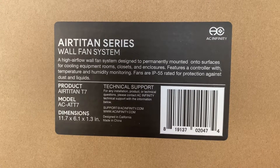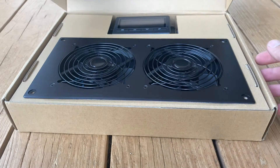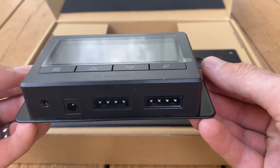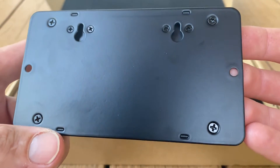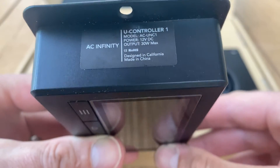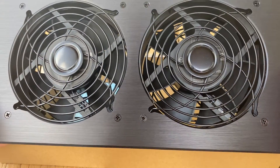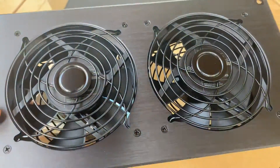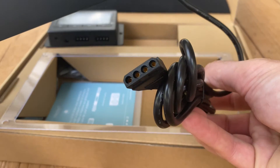What I'm doing is some work in my crawl space — I'm going to work on encapsulating it. If you're closing off all your vents to reduce humidity, you'll need a vent like this to create some negative pressure and pull any air or gases out of your crawl space. This is the control module — this is what the fan plugs into, along with your temperature gauge, and it just plugs into a standard outlet you may have in your crawl space, or you may need to run an extension cord. Here are the fans — this is a dual fan option. Basically it's going to pull air from your crawl space and vent it to the outside of your home via one of your existing radon vents, and I'll show you how to get that set up.